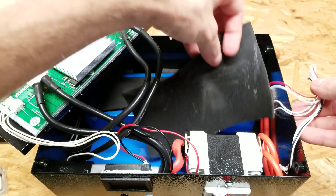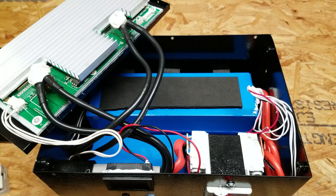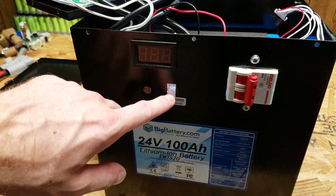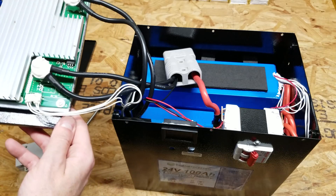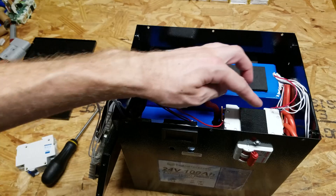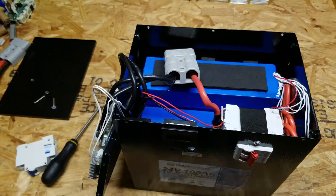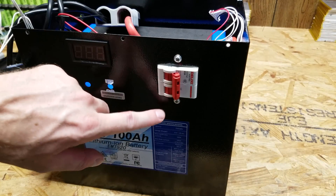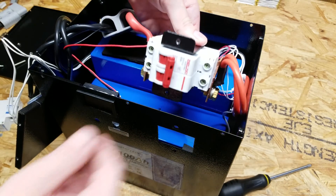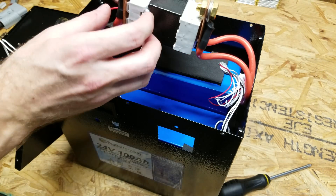Now I can remove this adhesive insulation piece. I also need to pull out this 175 amp Anderson connector, which is held on by two screws in the front — one here and one underneath the warranty sticker. We now have a little bit more room to move the BMS out of the way, which safely keeps all the negative controlled components away from the positive side. Next I need to remove the strap that's holding in this breaker. There are two more Phillips screws on the front, just like the Anderson connector. We can slide the breaker out the back — you can see the little bracket they built for it. It's actually a fairly neat idea.